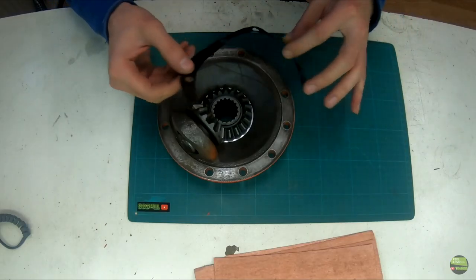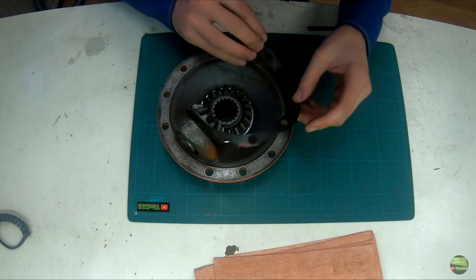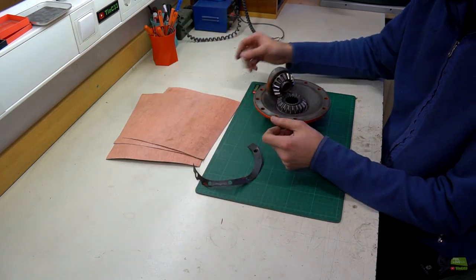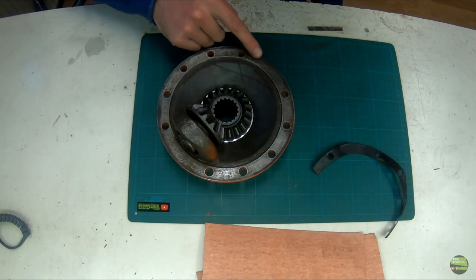The old seal was torn and solidified — shortly unusable — so I need to cut a new one out of sealing material, which is something between paper and rubber, 0.8 mm thick. To make the matching seal I need to cut two circles and then punch 10 holes for screws out of it. So let's make the tool to do that.